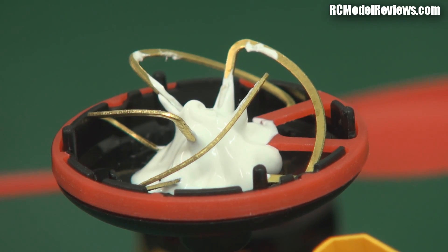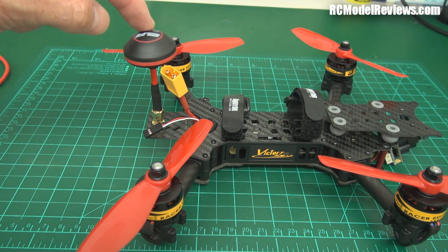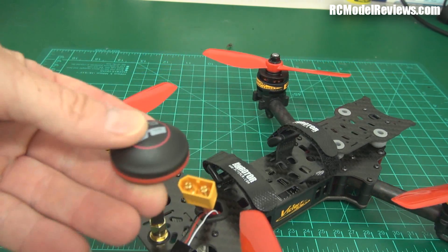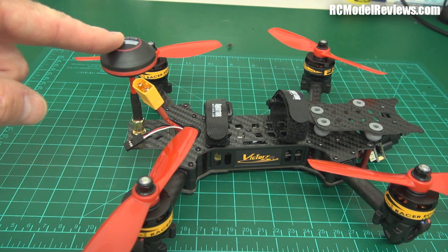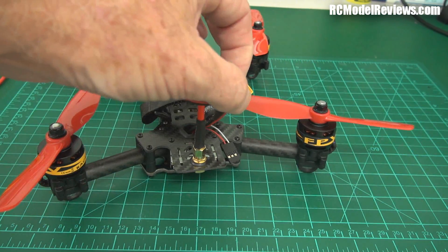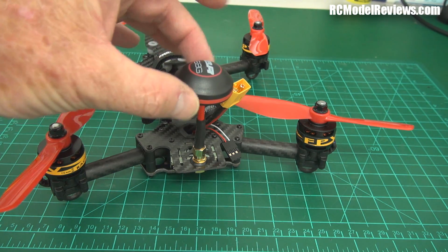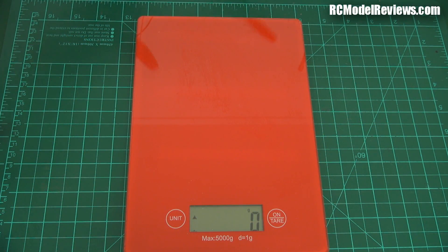Because the antenna cover came off so readily, I'd suggest taping it on — it's only held by a couple of small holes. If it comes off in a crash, your antenna gets more mangled than it already is from the factory. A little tape around the edge, some hot glue, or a piece of heat shrink of the right size would make a huge difference.